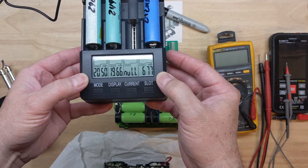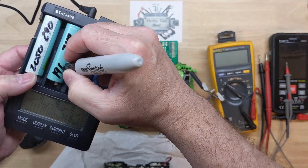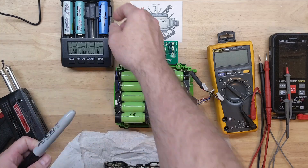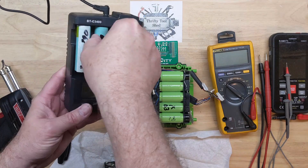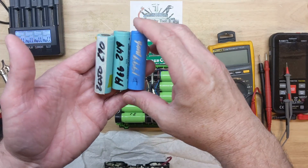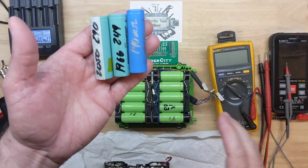The cells have now finished their test and are back fully charged, which is awesome. All I have to do is write the capacity on each one and this test is done. I kind of know exactly what I've got. But I'm not done yet — I'll set them aside and make sure the voltage does not drop off over time. It's not recommended to leave lithium cells stored fully charged, but I do it for my third and final test. I want to make sure that when I go to grab one and use it, it hasn't dropped down very low.